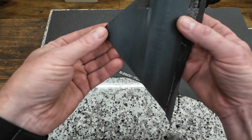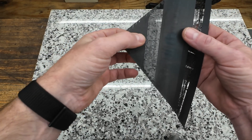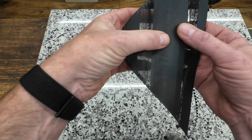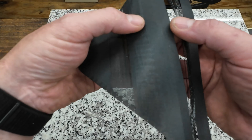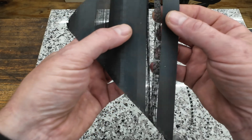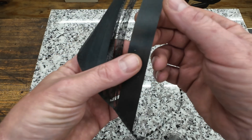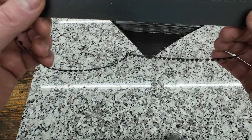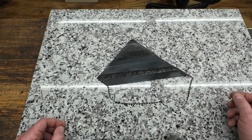Just to emphasize this a little bit, let me get some white behind this. So this was at 0.060, then 0.100 away. This next section is with the nozzle way too close, then back to where I like to be — real nice smooth bottom layer, nicely squished together. Then with the nozzle really far away, dramatically far away. And then again we're back to where I would be printing at with this printer — 0.075 millimeters. Hopefully that demonstrates and highlights what you're looking at on the Z offset.